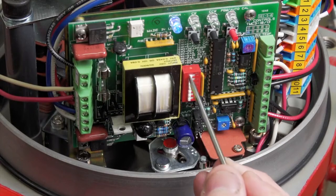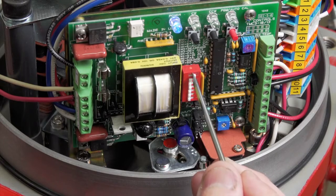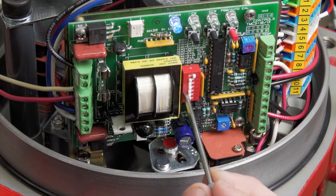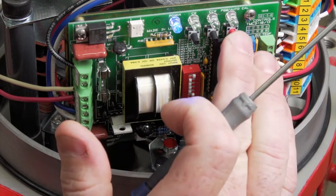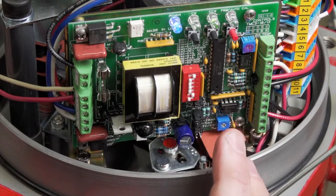One way of calibrating the TMC3 modulating card is to turn dip switch one on, which puts it in manual mode, and dip switch six on, which puts it in auto cal mode. Once in calibration mode, you hit the red button and the actuator will calibrate itself.